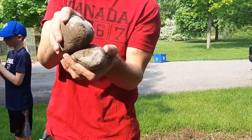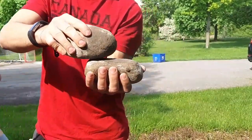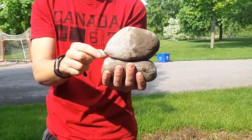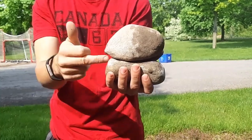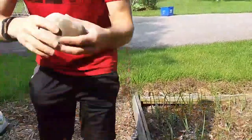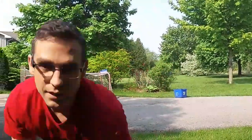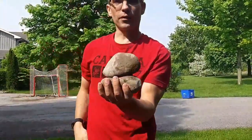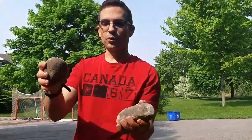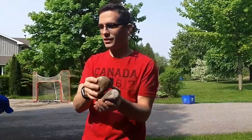You have extreme stability in soils when you stand and apply force vertically on them. However, when you have a hill and the soil particles are sitting at an angle, only a fraction of the gravity force is pushing straight down — the other fraction is going perpendicular. That's creating a shear force which slides the rocks. When I drag something across the surface, I'm applying a force this way, and the resistive frictional force of this rock pushes back the other way. So the forces on this rock are opposing, and the frictional forces in shear basically just pull the sand particles apart.